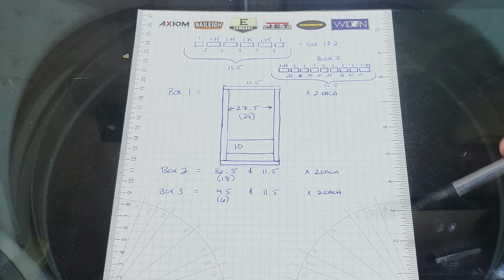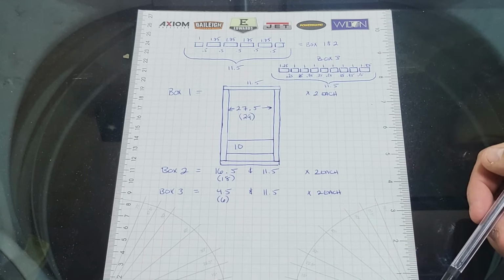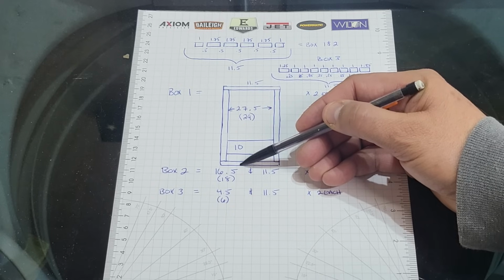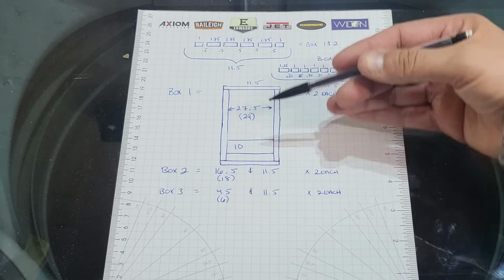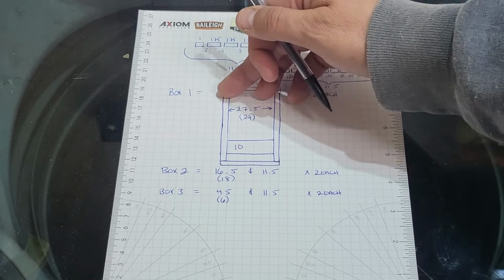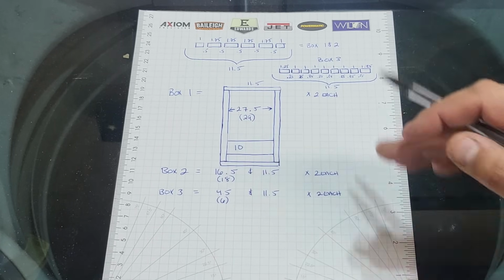Okay? So now I just need to figure out what size of pieces that I need, and that's pretty easy because I knew going into it that I wanted it to be 29 inches tall. Okay? And I know that I'm using 3/4 inch material, and so I have 3/4 here and 3/4 here on the top and the bottom. Again, I'm putting the tops and the bottoms overlapping the sides, or sandwiching the sides in, because most of the pressure from the clamps is downward up here. So rather than having all that pressure on the glue and brad nail, or if you screw it, screw joint there, the pressure is all getting put into those long boards there, and it's much more stable that way. So that's why I designed it that way.